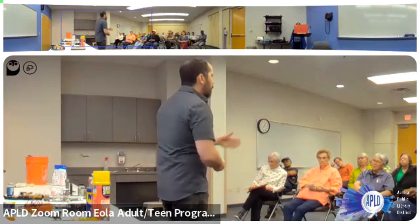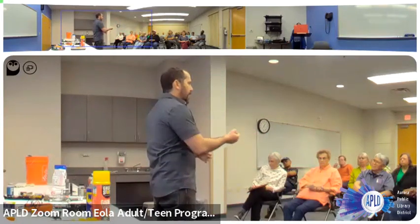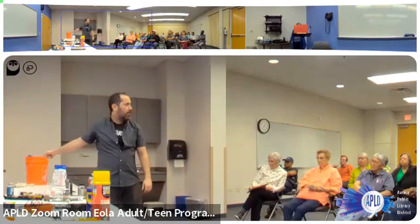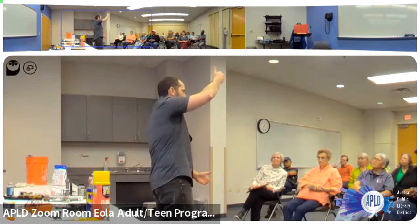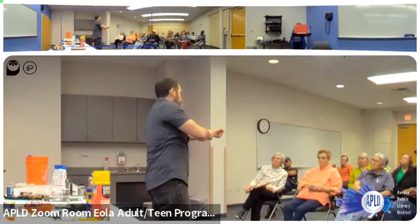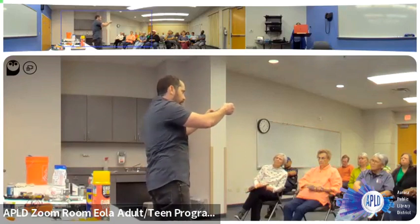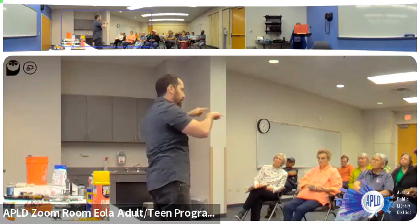But if this is just in the middle of the wall, all you need is some kind of stick. Put a little caulk or construction adhesive. Stick's gotta be longer than the hole, right? Stick it in there, hold it, put a screw through the drywall that's still good. Usually two sticks is the right number, okay? And stick that patch on and screw to those, okay?